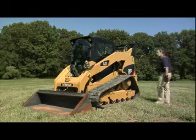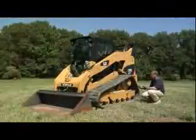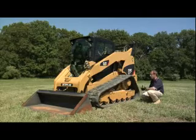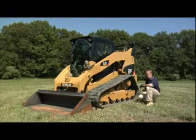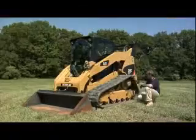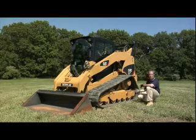I'd like to talk a little bit about the sprocket itself. You can see how it's bolted on here — that's the part you will change when you change the track. Usually you change the track at the same time as your sprocket. Something important to be aware of: the track itself is longer than on the competition. It's actually 10% longer, so for any given distance you travel, the steel bars within the track are going to meet that sprocket 10% less often, meaning 10% less wear out of the track.